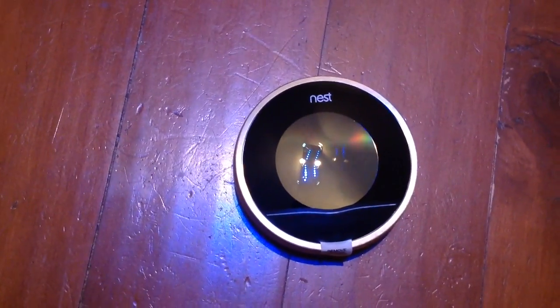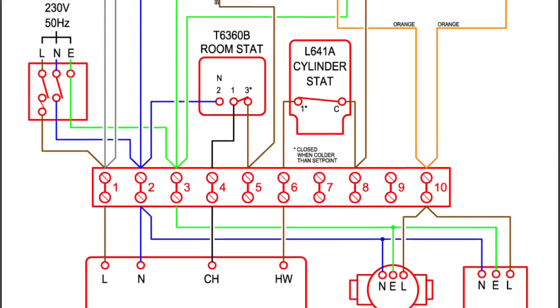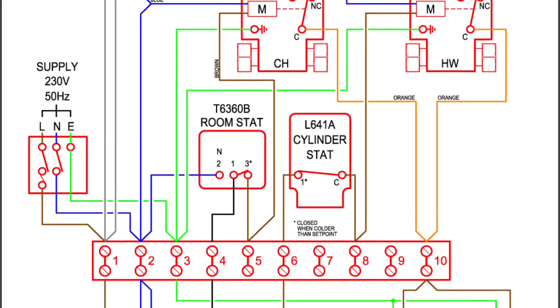Here's our main unit. Please don't fit it upside down. If needed, this is how it will sit in the back plate. If the thermostat in your home is actually a wireless radio frequency thermostat, just remember this actually requires power — only 12 volts, but it still requires two wires. Remember, a lot of installations do not follow the average wiring diagrams. Take photos of your wiring before you start just in case any wires come loose. Inside these boxes it doesn't look all nice like the wiring diagrams, so this will give you an indication of what you're up against. Remember to isolate any power before removing this box.